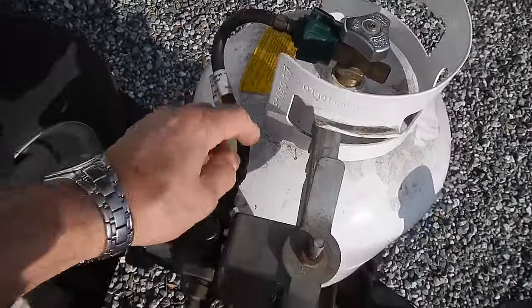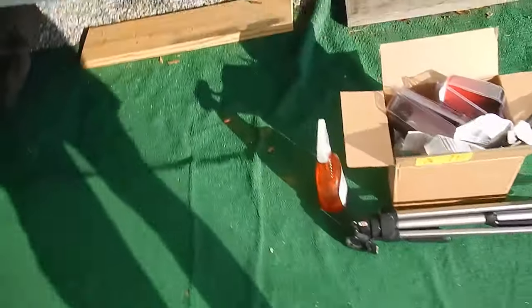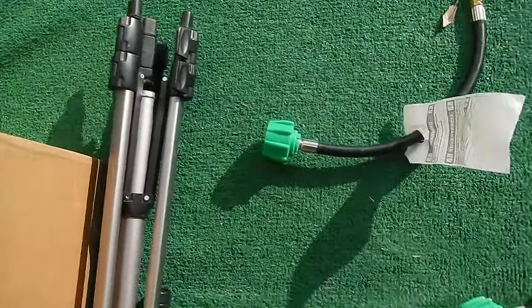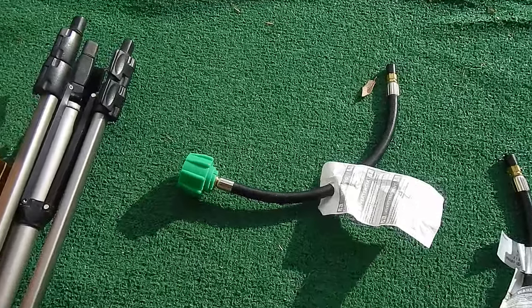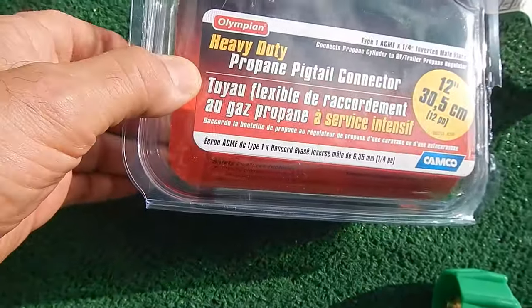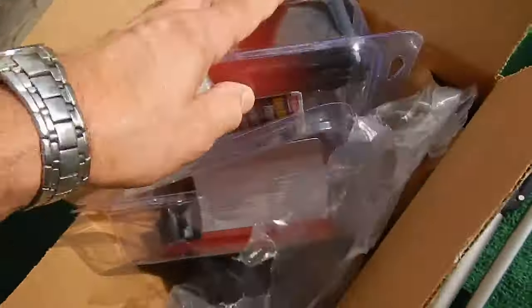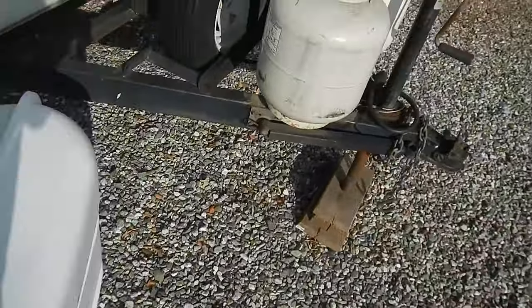So the first thing I did was determine that I had a leak. I'll get the camera set up to show you how easy it is to replace them. Rather than mess around with any attempt to repair the hose, for eleven bucks you get a new 12-inch propane pigtail. I found them on the internet — shipped to me in just a few days at about eleven bucks a piece plus eight bucks shipping.